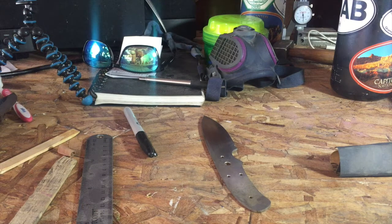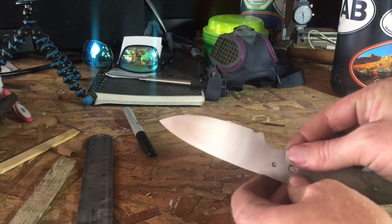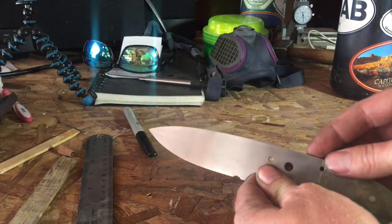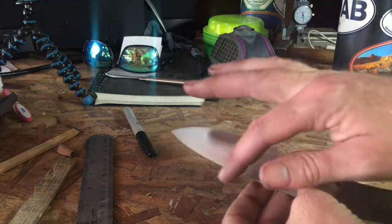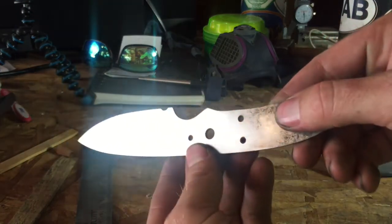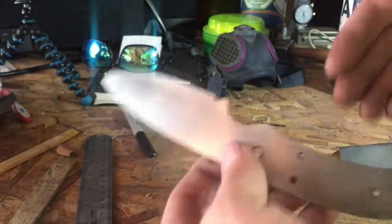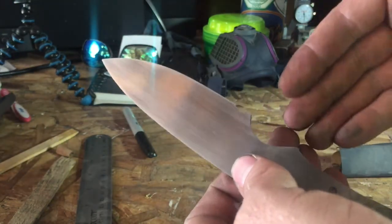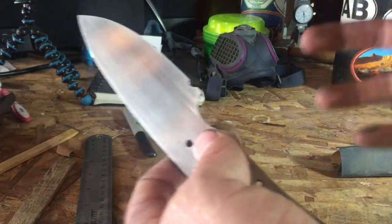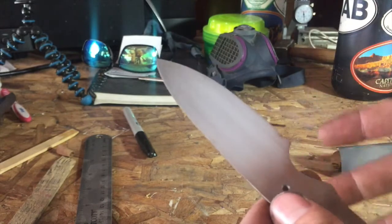To increase your chances of a successful quench, it comes down to your preparation. I like to polish my knife up a little bit to make it easier after the heat treatment. You'll want to clean your edges up so it's smooth, and you'll want to chamfer your holes so you don't have any 90-degree sharp corners. When you have a 90-degree corner it's a lot more prone to breaking during heat treatment because there's a lot of stress in the steel and 90-degree corners are more prone to breaking.